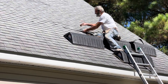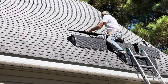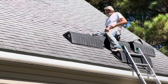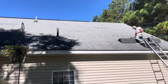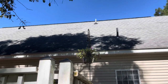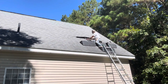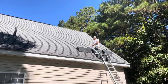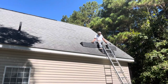We had a shingle that apparently came apart and he's just replacing that one shingle. It looks so much like the other ones — it's almost a perfect match. They called me out here wanting an estimate to replace the whole entire roof, but it's a 17-year-old roof. Although there have been a repair or two, I cannot imagine replacing it — this is absolutely an architectural 30-year shingle and I'm estimating 25 to 27 years easily. I wouldn't want to throw away 10 years worth of roof. I knew they needed a repair and possibly a roof cleaning, which is something we also do.